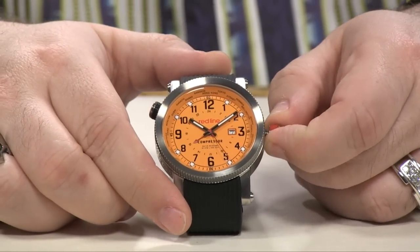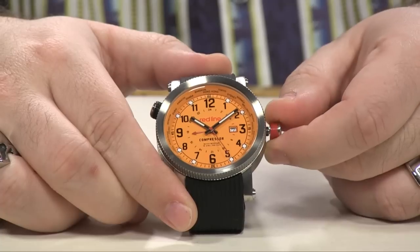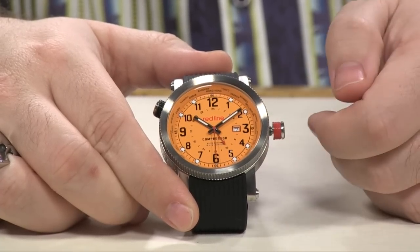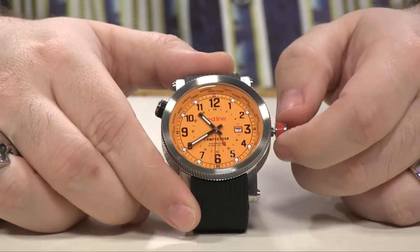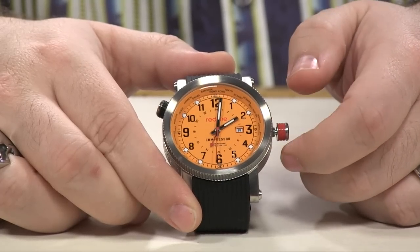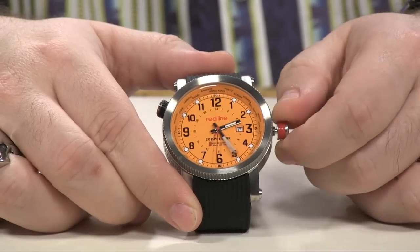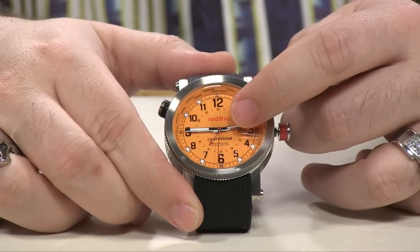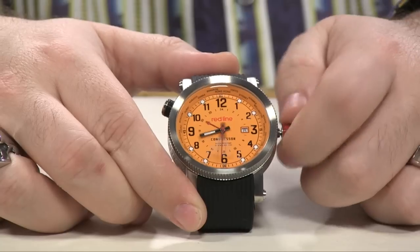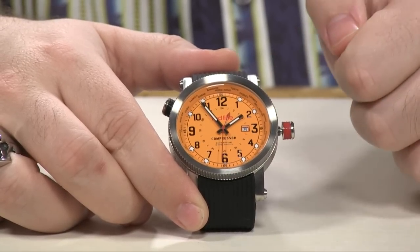You can also use this as a very simple AM/PM or military time indication of your current time of day. So you can have this set — if it's going to be AM, there is your 10 AM. As it goes around it will keep track. 2 PM would be 1400 hours, so you have 2 PM there and 1400 hours there. Keep in mind this runs on a 12-hour format and this runs on a 24, so your hour hand will actually pass your GMT hand throughout the day because one is underdriven off of the other.